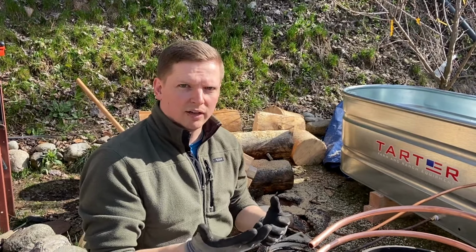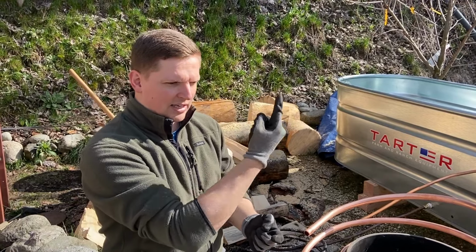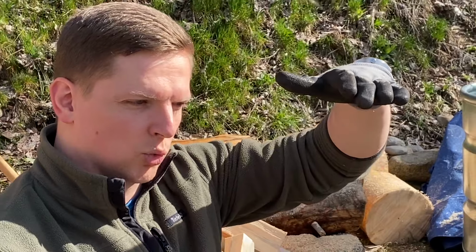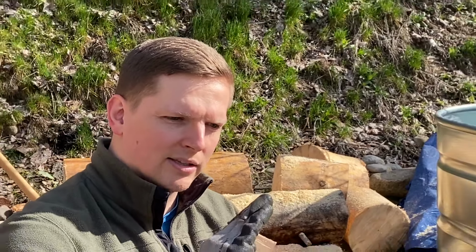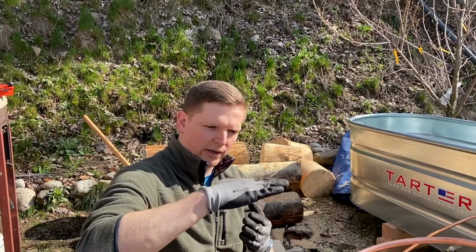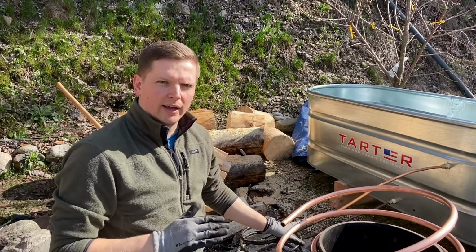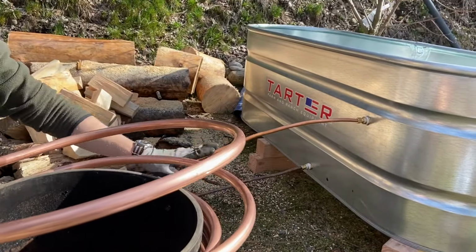The way thermosiphoning works is that basically the hot water rises up the coil as it heats. And if the coil is just way too tall, with more than 5 or 10 coils, it gets really out of hand with the water not having time to go up. And if there's not enough of a slant for the water to rise, that's also a problem. So if the coils are very flat, it's worse. You want them to be somewhat angled, and also the exit pipe needs to be going up so that the thermosiphoning can take effect.